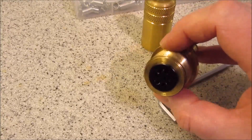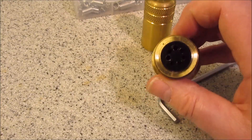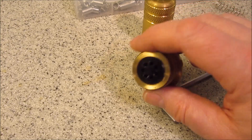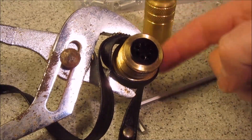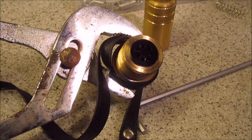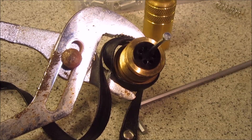The actual cap on there needs to come off to get to the spring on the exhaust valve. They do tend to be quite tight, so here's a good trick to undo these things. I've got a leather strap around that side of the brass valve because I don't want to damage it. I've got some grippers on that, and basically put two nails through it so it fits.